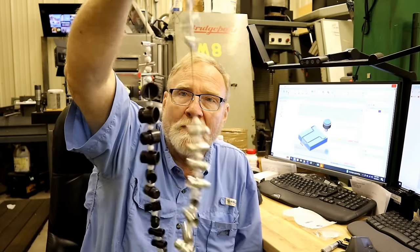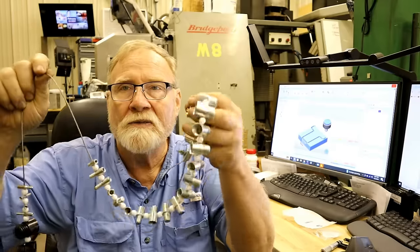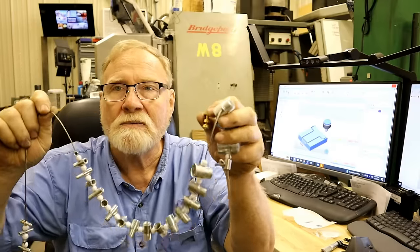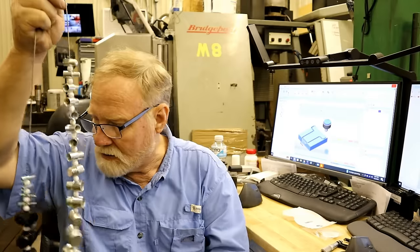You say, well, that's what thread checkers are made for. I've got one. A huge one. All metric, all everything. None of those fit this thread. It looks to be somewhere in the quarter by maybe 32. There's a lot of different threads that aren't on these things.